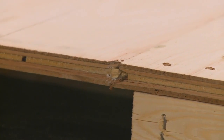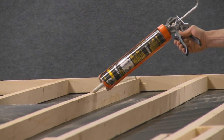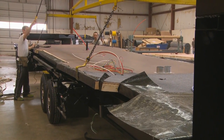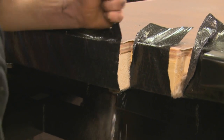Next, the floor is enclosed with a residential-like 5/8-inch tongue and groove plywood floor. The plywood is installed onto the floor joist for a consistent bond. Once completed, the floor is lifted onto the steel frame and then bolted to the frame outriggers with heavy-duty carriage bolts.